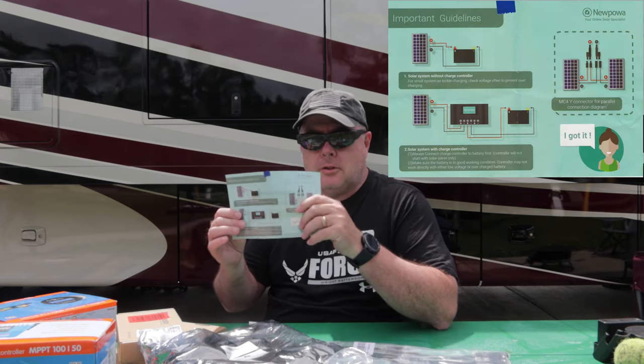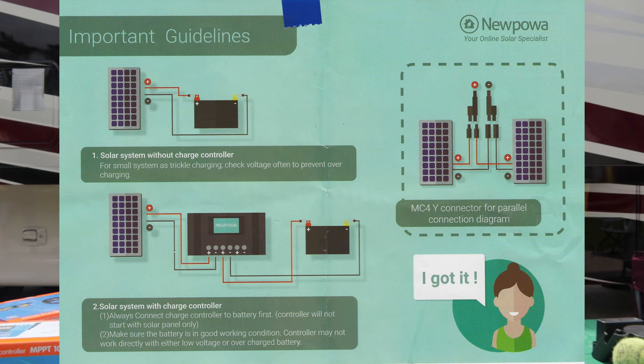The solar panels came with a handy instruction sheet — I'll put that image up on screen because it gives a really good simple explanation of everything you need to hook up solar. When doing installs like this, it's very important that you don't have the battery connected to anything until you're ready to go. Install the panels, charge controller, battery monitor, and circuit breaker before connecting to the battery — otherwise you might get a shocked. Also, take your time with the wiring. Make it nice and straight with good 90-degree bends. If something breaks, a rat's nest is much harder and more expensive to fix than a neat professional job.